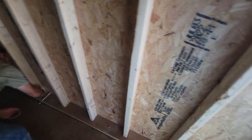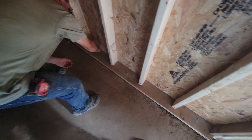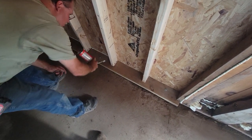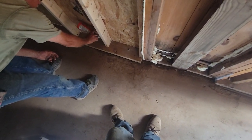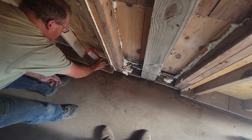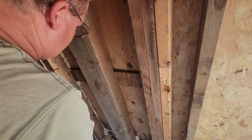We're going to flash it. The reason we chose synthetic roofing paper is because it doesn't tear — can't use felt paper, it won't last. Tyvek is only good for six months exposed. The roofing paper is pretty strong — I've left it out for a year before. Nothing is going to last forever, but I wanted something economical. Tyvek is a good choice too, but I got a 100-foot roll for a 25-foot room — a bit too much.